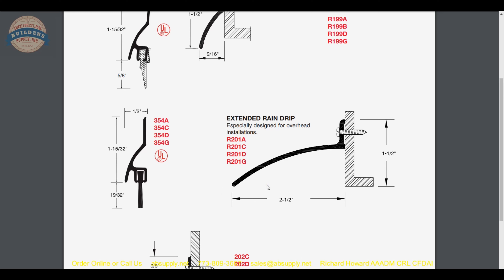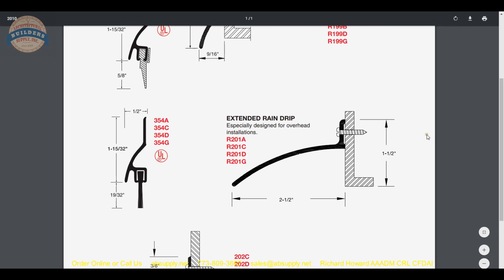I have been called out to job sites to help diagnose mystery infiltration of water where the roofer had been there, the roof was completely intact, and the weather stripping was certainly installed — the whole nine yards. Every time there was a reasonably heavy or even a moderate rain, water got in and was soaking the carpeting. I have never been not amazed when I have seen water get into places I couldn't understand how it did. I said almost as a last resort: install some drip caps.